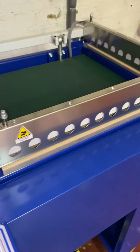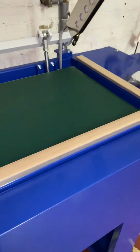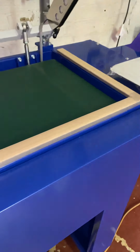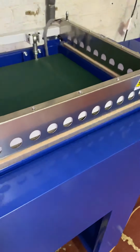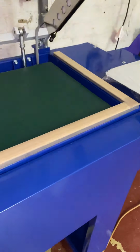The next along is set at 3. That is how long the seal arm stays down and allows the seal time to gel, just so you get a better seal integrity. If you put that too low, the arm will come down and pop straight back up. You'll get a weak seal. You'll probably turn it down to 2. We've got it at 3.